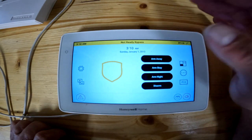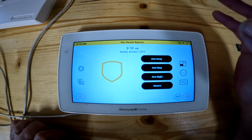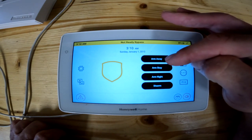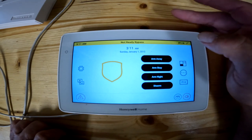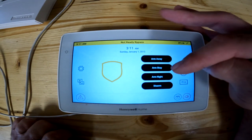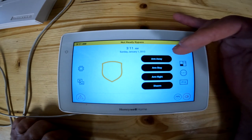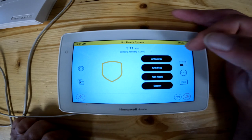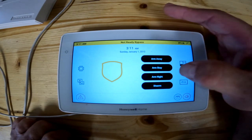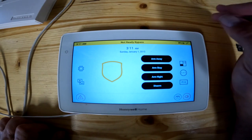You can program a door to be arm away or arm stay mode. Mostly that's set up for motion sensors. When you hit arm stay, the motion sensors are disabled so you can walk around inside the house but your perimeter is still set. If you've got an office area, you could still program one of those motion sensors to be triggered while the alarm is in stay mode — so make sure you talk to your installer and set it up correctly. Arm night can be configured different ways: stay mode, away mode, or you can set it to instant or maximum. If you set arm night to instant, there's no delay in or out — once you set the alarm it's set, so if somebody comes through the door the alarm goes off immediately. That's basically for when you're home at night going to bed and you know no one's going to open the door. I tell most customers not to use that, especially if they have pets — if you go to let the dog out in the middle of the night, the alarm goes off instantly with no time to turn it off.